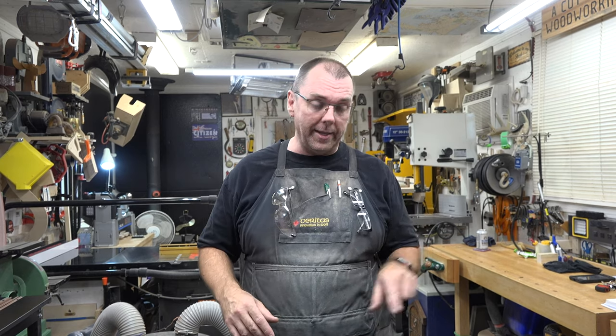And there you have it. My top 10 list of safety tips for the wood lathe. You've heard me say it before, this is not a definitive list. This is not the beginning and end all. This is just my top 10. I'm sure there are plenty more that we can mention. Things like cutting the corners off your blank when turning it round so that you're turning more of an octagon than what you are a square. Or cutting it, you know, rough shaped circle.